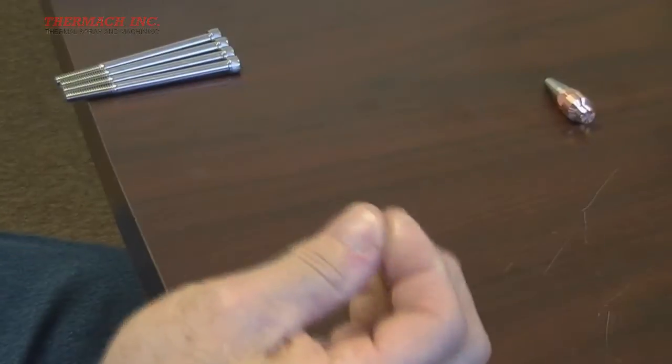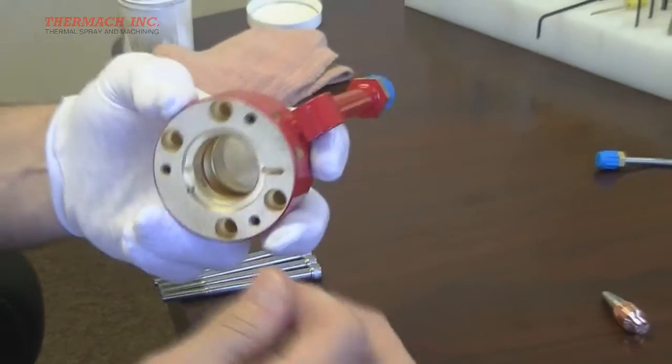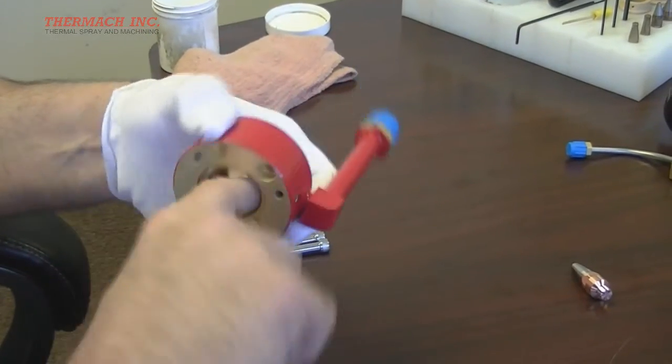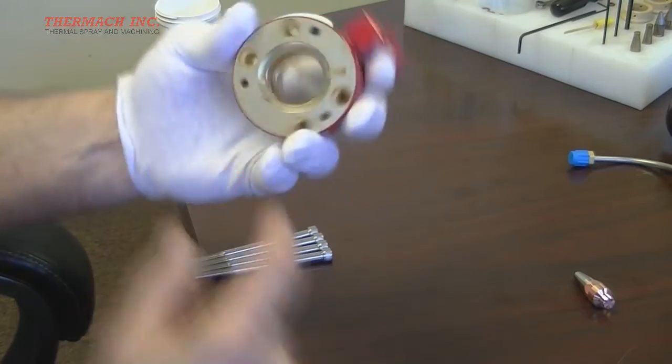The majority of o-rings will need lubrication to avoid rolling, repositioning, and breakage. We will look quickly at those o-rings that require lubrication and point out those that do not need lubrication as well. To begin, place a small amount on the index finger and rub between the index and thumb so only a thin layer is applied to the o-ring. Both o-rings on the front housing need to be lubricated.